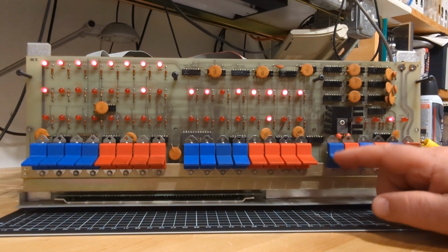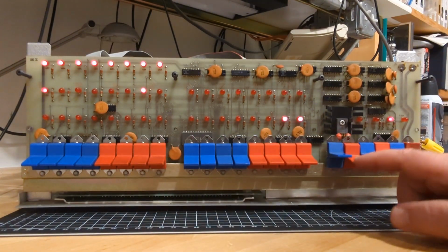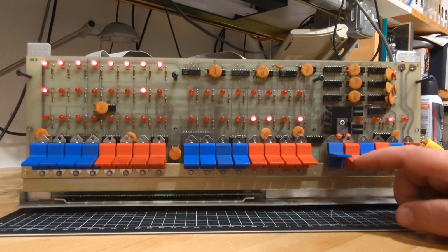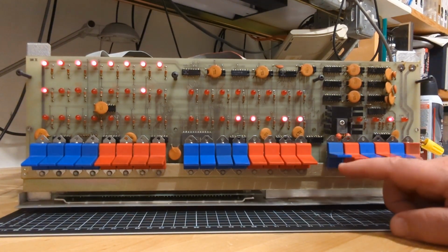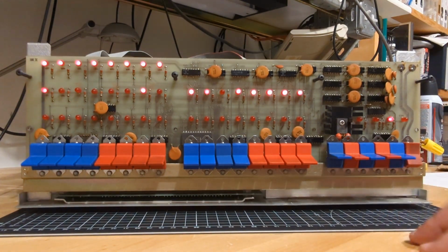As we saw a minute ago, if I click through here, I'm reading garbage that happens to be in the memory. Let's go ahead and just deposit a bunch of zeros in here. Now, we've done this a number of times. You can actually sort of see it flash as it goes through and stores the zero in there. What we're really doing here is we're seeing the old value get replaced real quick as we go through deposit and deposit next like this. So if we go back and examine them all,